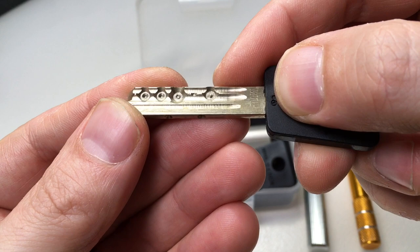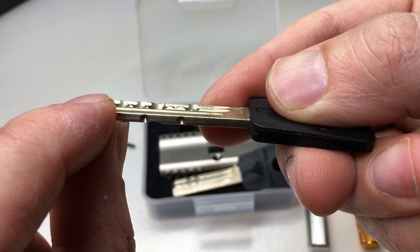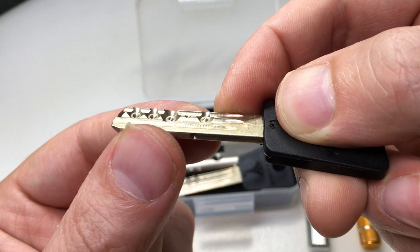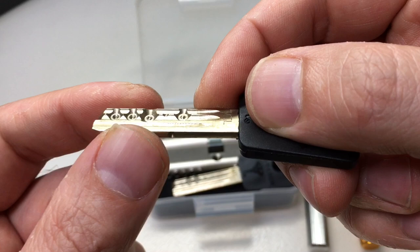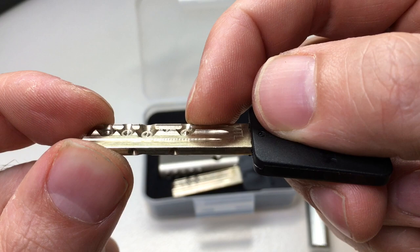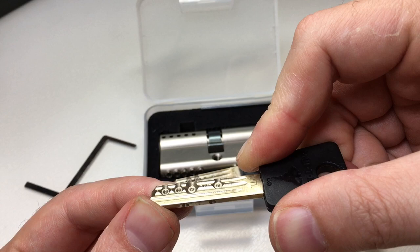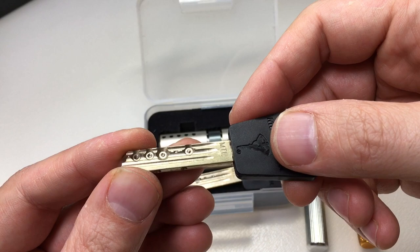And this is a little bit harder. Look at the biting. If you turn to the edge, you can see that we have a really long keypin in position three, which protects four and five. And in front of it, you've got a very, very short keypin which needs to lift all the way up. And not only that, you've got a very cheeky pin-in-pin — the inner keypin at pin one. If you can see, it's raised by about a millimetre high. That means you need to push the inner pin lower, or higher, depending on which way you look at it, inside the outer pin.